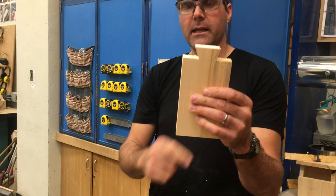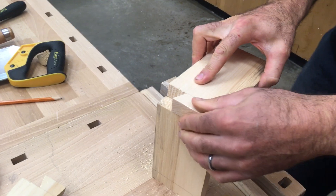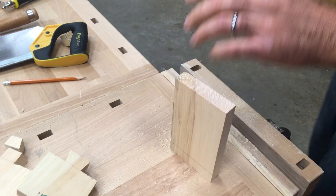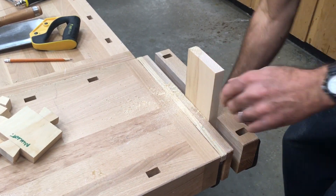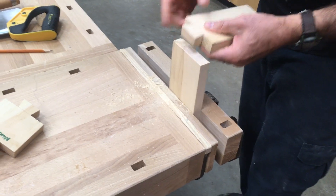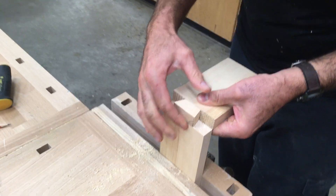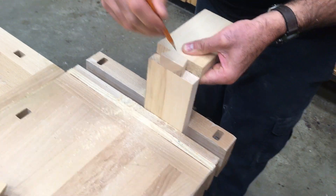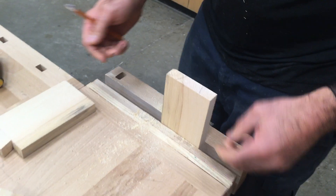This one's a little off — you can see this side is angled more and this side a little less. Don't worry about that. Now we're going to make what's called the pins — two pins here to fit the dovetail in there. You're going to line the shoulders, that's this part, up to the edge of your board, and with a nice sharp pencil you're going to mark the edge of your dovetail on there.